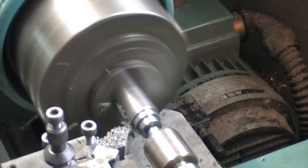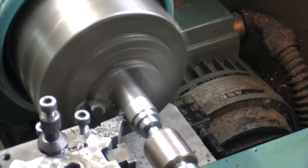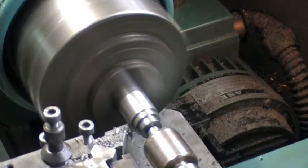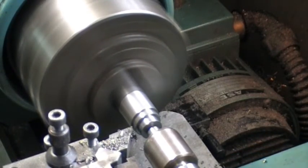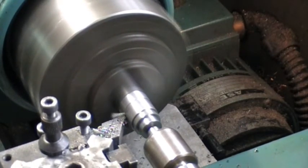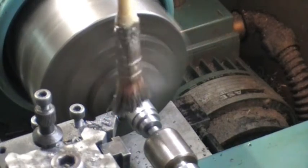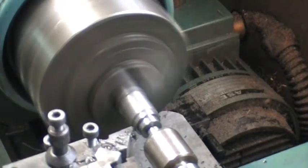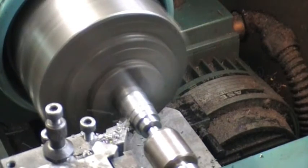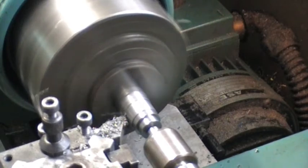It's now going to cut the OD for the cylinder fins. This OD is cutting to finish at 16.76mm, starting from 19mm, doing these three easy cuts. I'll give it a touch of fluid. It will slow the feed down with the manual feed control to get a fine finish on the surface of that part.